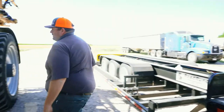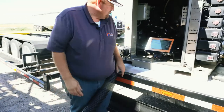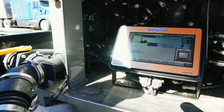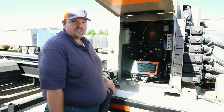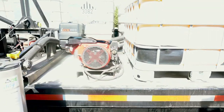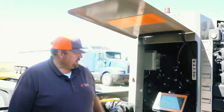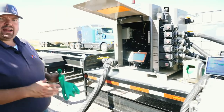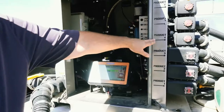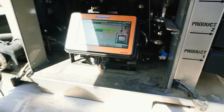Before we do that, we need to ensure that all of our valves are open, and then we'll come back and mix the batch. To do that we simply press start. This system is equipped with the iGX engine from Honda — it has an electric choke and start on it, so simply pressing the start button is going to fire up our engine. Currently we're just finishing up putting in our preload. At this point I'm ready for the next products in the batch, which are going to be my two automated chemicals. So right now I'm pulling out of tote number four, moving that chemical in at 24.1 gallons per minute. As we approach that set point, it's going to go ahead and shut off just as it hits that set point.